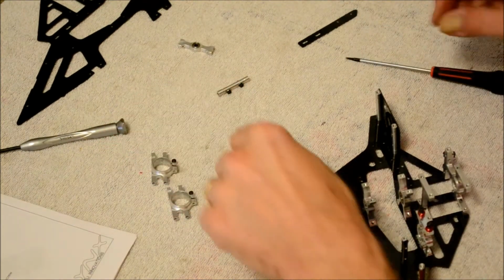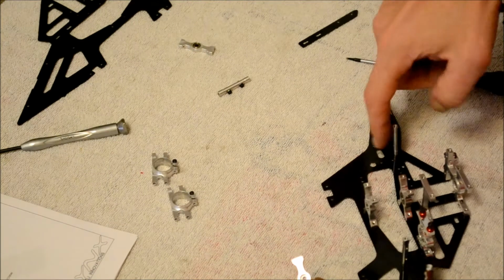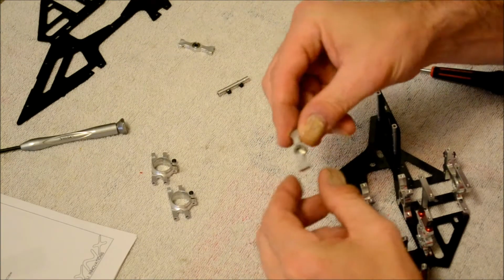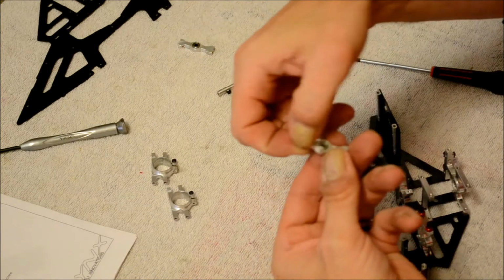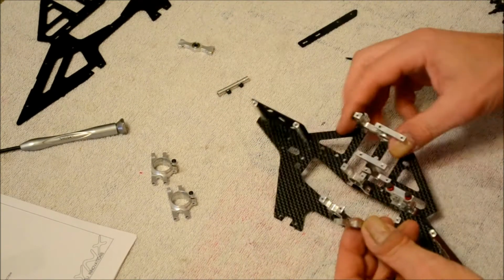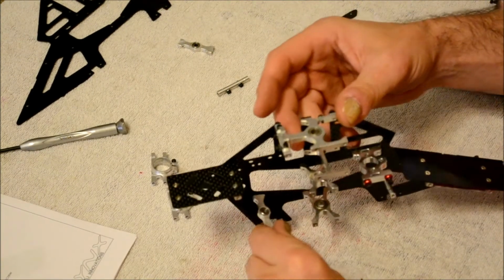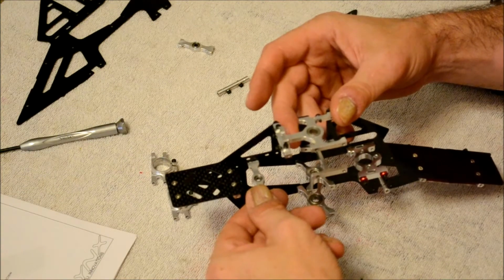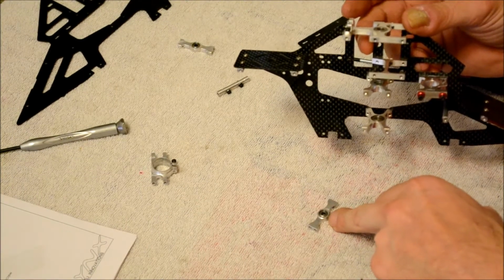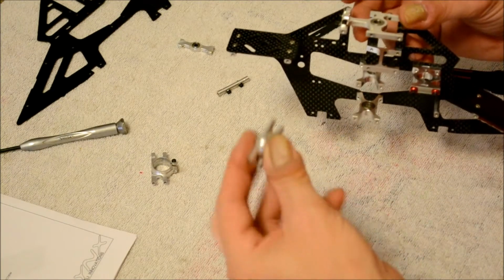And now we'll be mounting the lower for the tail drive gears, or the tail drive, man, I can't remember the name of it. The tail drive jack shaft. We'll be mounting the bearing for that. Now, point the bearing toward the shaft. So, in other words, like now on here, it'd be sitting like this. The lower one would go like that, bearing pointing up, and then the upper one would go bearing pointing down. Now them I would put Loctite on, but don't torque them either, because we want to put that jack shaft in, and once we put that in, we then tighten it down. That way it's square on the shaft.